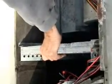This is the condensing coil. This is what removes the heat in the summertime and actually collects the heat in the winter — because this is a heat pump. And I've pointed out this component right here, which is a reversing valve, and that basically is what makes this system a heat pump. This is the evaporator coil. When you get a call for cool, this is what removes the heat and sends it to your condensing coil to be removed outside.